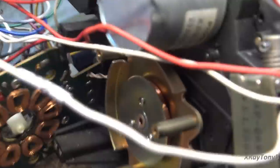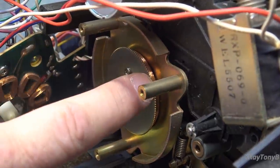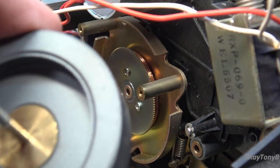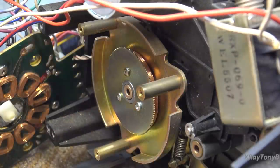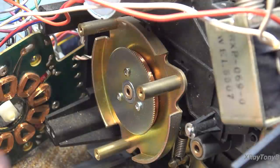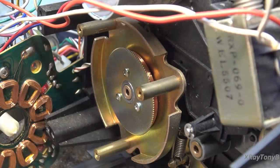If you look up here where this came out, you can see a stator plate and it also has little serrations cut in it — it's coupled to a coil back there. What this does: there's a magnet, this is magnetized, and as it rotates these teeth create a little pulse train which acts as feedback for the speed. It's a tachometer feedback circuit. We want to take this out so we can service it. The two wires there are going to be tighter than banjo strings if you move it too far.